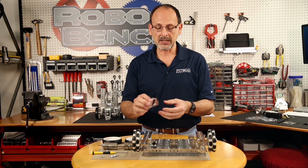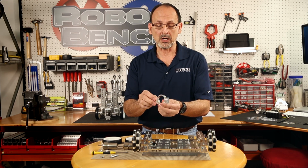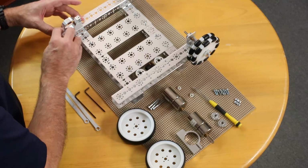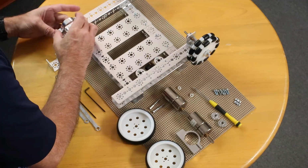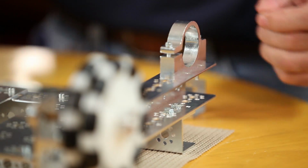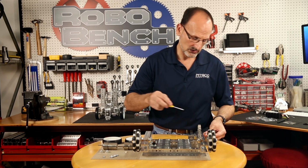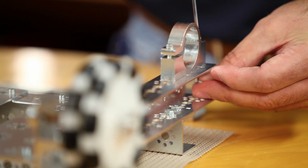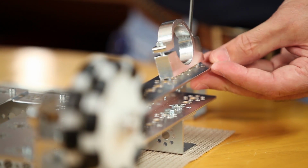So you'll notice the motor mounts have actually two different sizes. They're going to use the longer 1.5-inch bolts, but we're going to start by putting those on the opposite end. And we just want to kind of center them up in the channel. And again, I put them in place like that, and I can take my cap nuts and my wrench. There's two different sizes here, so I can start by putting the solid side down first.